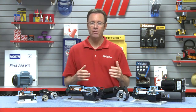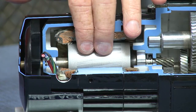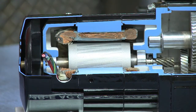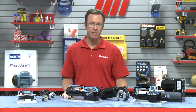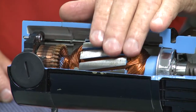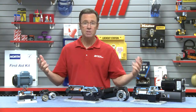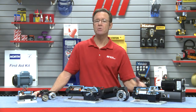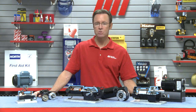Now that we've talked about the kinds of gear heads, let's look at the other half of a gear motor. This is an AC induction motor right here. They're economical to run and maintain, and they usually produce less heat than their permanent magnet DC counterparts. AC motors are great for fixed and variable speed applications. Next up, permanent magnet DC motors — right here in this cutaway. They have a linear speed-torque performance characteristic and are simple to install and operate. PMDC motors are used in everything from industrial conveyors and medical devices to low voltage solar applications.